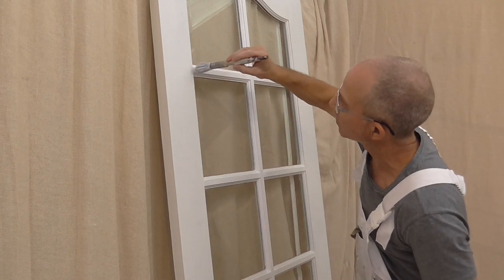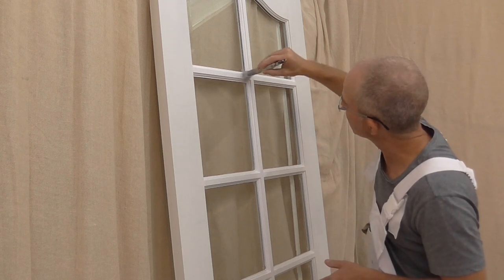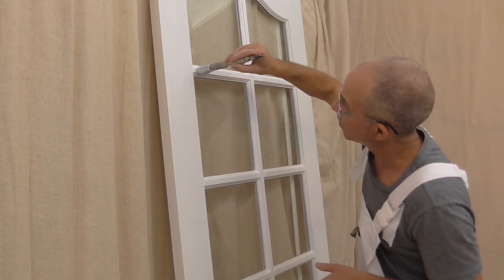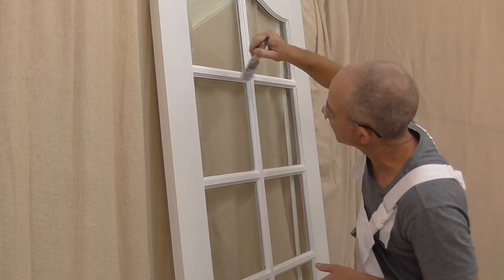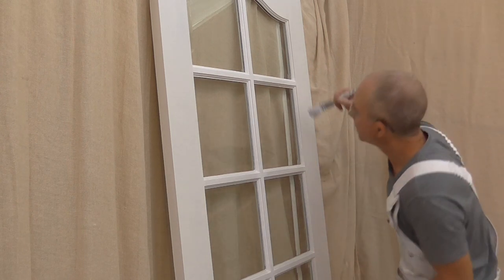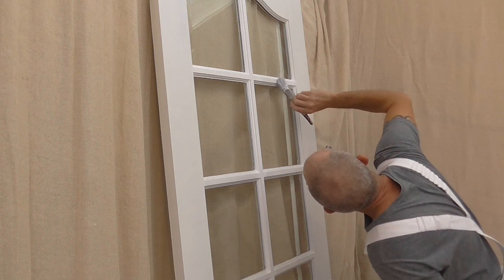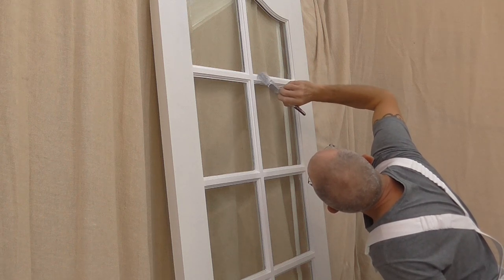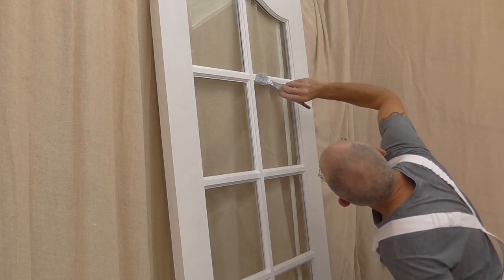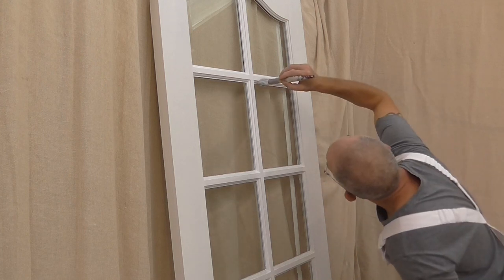Good thing about oil gloss, a few passes and it actually builds up, it grips the surface and builds up. Water-based seems to just, you know, come off literally as you're putting it on. You can't seem to build it up, but with this oil it seems to grip the surface a lot more, like you would expect oil to. And just pulls the rest of the paint together. I love it. If you could just come up with one that stays white, satin wood is good. Satin oil.